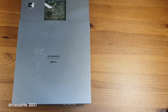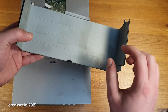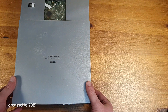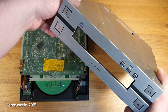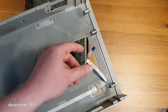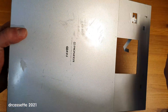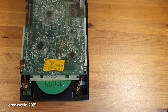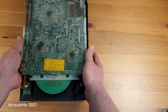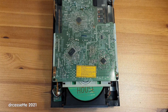It turns out the system is held together by really cheap screws — the ones that only take two turns to get out. The first thing that comes off is the black cover in the back, which is actually made from metal. Then basically the whole entire case pulls off towards the front. The buttons on the front connect to the main unit via a ribbon cable that plugs in right there. The case is made from plastic, but there is a metal panel inside to provide shielding to the circuit board on top, which is covered by plastic to provide insulation against that metal panel.